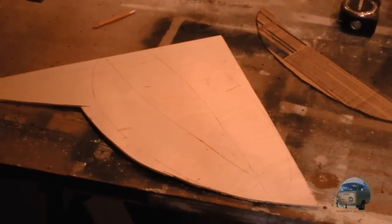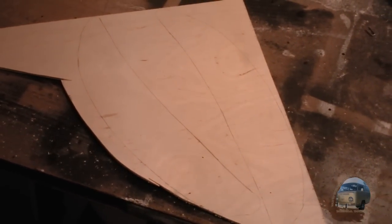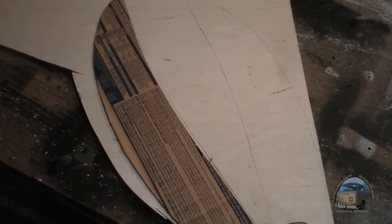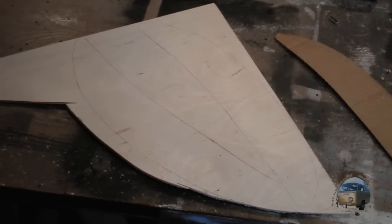Just checking in here. The next step is going to be using your template to trace out your scoop covers on a piece of wood. I found a nice piece of scrap wood — this is from cutting out a wheel well area, you can see the arc there. When you do this, don't forget that you trace one and then you've got to flip it over to trace for the other side. Because they are the same size, but if you do two the same way, it's not going to fit on the other side and you'll feel stupid. I just caught myself almost doing it, so I thought I'd remind everybody of that.